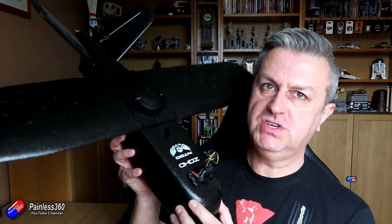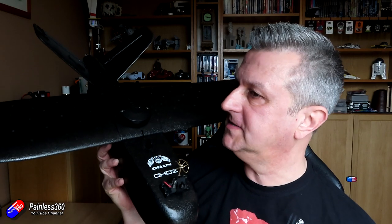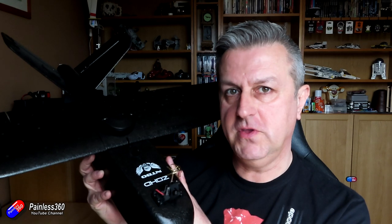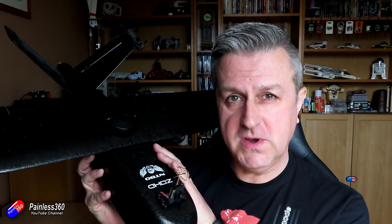So there we have it — we've gone from lots of things on the bench to everything installed inside the model and ready for the test flight. A couple of things to make sure of before you leave the house: first, double-check that you can arm it and that all works okay. Also double-check that when you turn off your radio, the motor stops running and the ArduPilot detects failsafe. The receiver should detect when that happens and send that information via the S-bus connection into the flight controller — just double-check that before you go to the field.